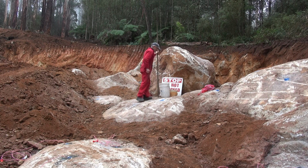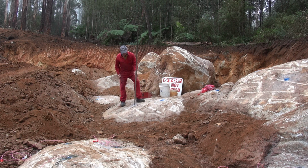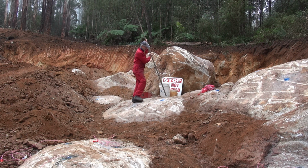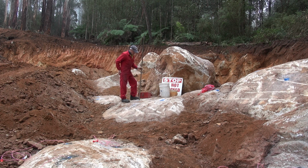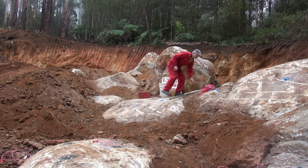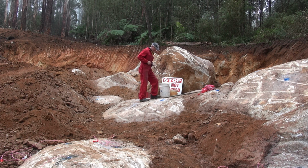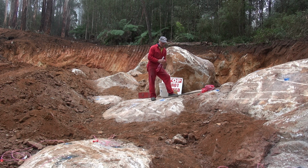Okay. Checking the holes are all dry. They're all about 1150 mil deep, which is what I want. Each of these holes is going to get a slug of 32mm by 200 package demolition, 185 gram plug, and that should suitably mess it up.